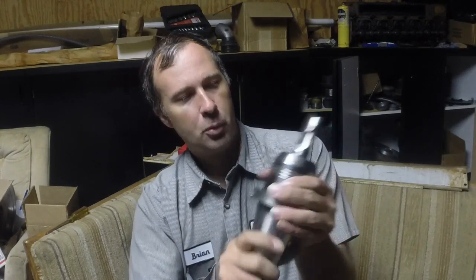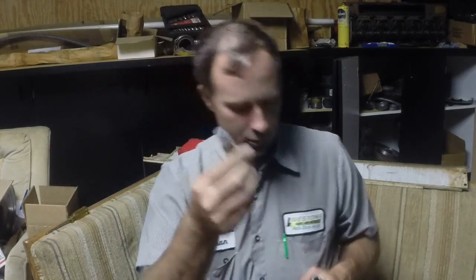So there's that Gühring — that's how you say that. Now it's completely ready to go in the mill. Pull the stud and holder, give me one of my tool numbers. I think it holds 30, so you can put a few in there. Let's try this little 12mm Gühring. I actually use their end mills — it's one of my favorite end mills for manual milling.